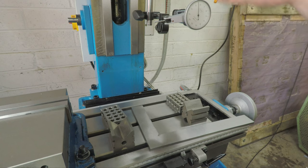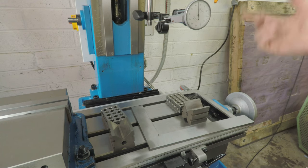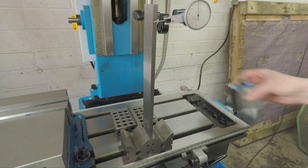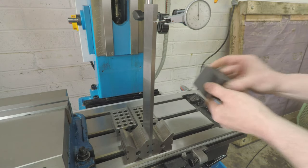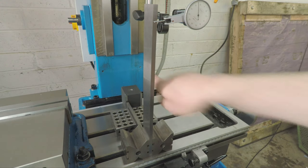I've set the gears to low and the bar is pushed into the gears so it cannot turn, so as the force on the needle is applied it should not have any movement from the spindle. I've set up with 1-2-3 blocks and I'm going to use a magnetic base to stop any movement.